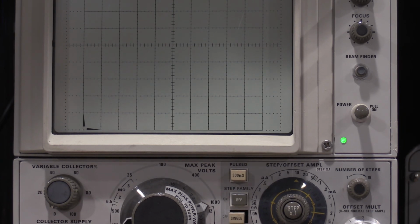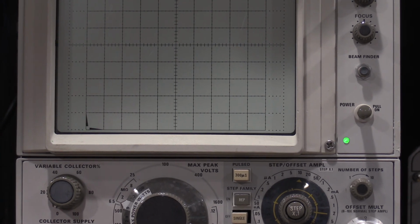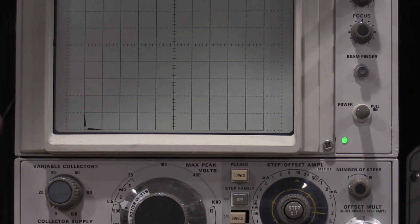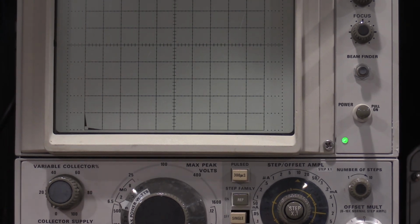The other thing on these diodes is they're fast because they're rectifier diodes. They're high current rectifier diodes, so they're quick and they have some pretty insane breakdown voltages. So I'm about to touch the diode again just to be sure, because I had this turned all the way up to 1600 volts collector. It's all the way back down to 6. The variable is all the way down to 0, and the 177 is out of the test fixture simply because I don't want to touch 1600 volts.